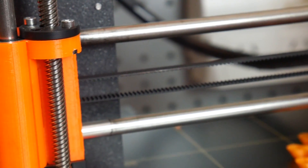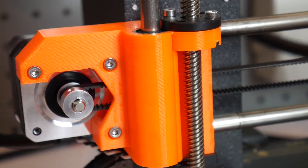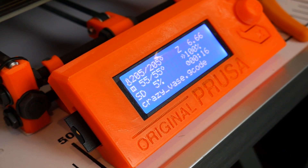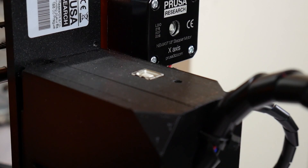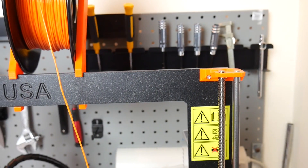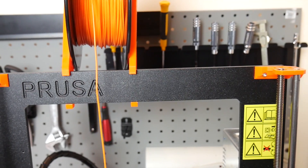The design of the MK2 may be familiar to some and completely foreign to others, being constructed almost entirely of 3D printed parts. In fact, Prusa Research runs a humongous print farm to print out all the parts for their printers, and the machine is completely open source. Very respectable for a company to go down this route and not stab its community in the back — MakerBot. The LCD and click wheel interface works a treat, and you can load G-code onto the included SD card, or run tethered by interfacing directly with a Rambo Mini control board. Thankfully, the upright verticals, which are a critical support member in the i3 design, are 6 millimeter coated aluminum, which provides a stiffer chassis than laser-cut acrylic would.